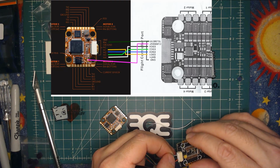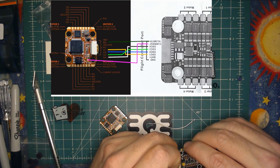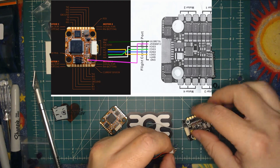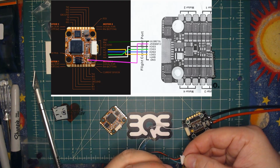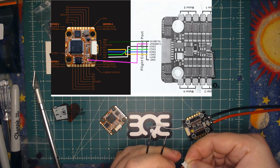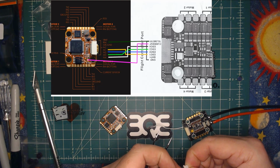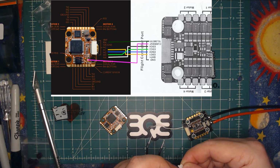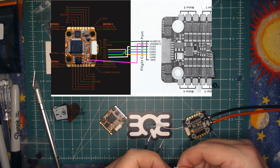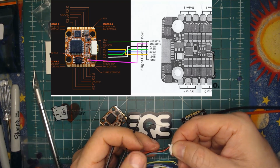And again, oh, see, it came back out. So once you get them in, pull your JST back off. Use some tweezers, give a little push in, and then push down on the tab to help lock it in there. And usually, oh, I didn't quite make it. Once you get it in and you push down on the tabs, it's going to lock. And again, you just want to wiggle it back and forth very gently to make sure that it's not going to come back out.